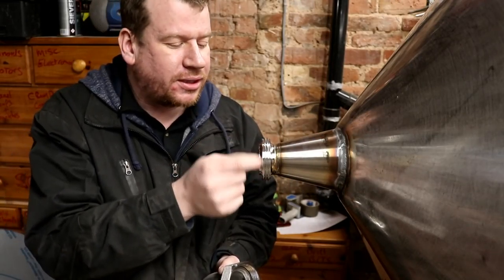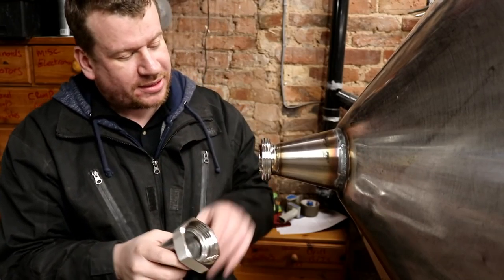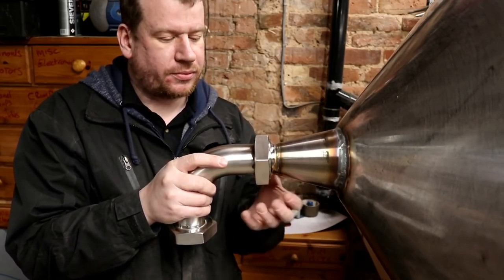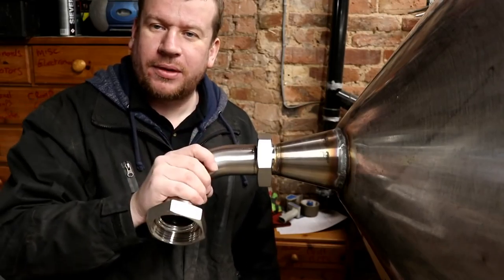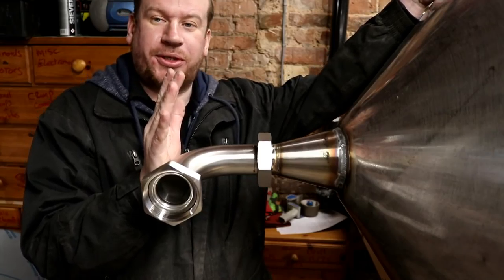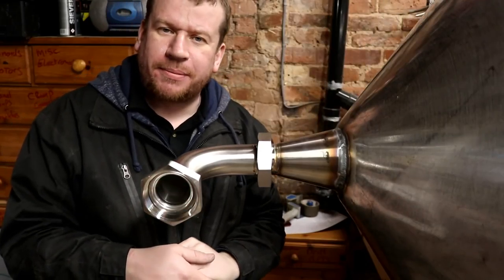What you would normally have around here is a two inch RJT seal, which is basically a rubber O-ring - they're on the way, I don't have any in stock. Once that seal's in place you engage your two inch liner and tighten up your nut. Once you've got the nut on there you can position the outlet at any angle you like. This is obviously what the base of the tank is going to look like, so we know our legs are going to have to protrude at least that far, at the very minimum, and then I'd like a couple of hundred mil to put some type of bucket or tray underneath.